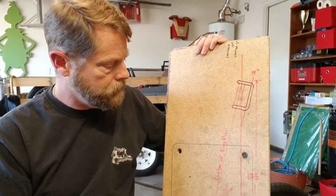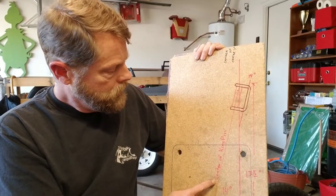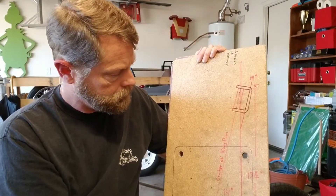I'm running a quarter inch toe-in, so the front wheels are toed in a little bit — measuring from the center of the tread, it's a quarter inch narrower at the front. Kingpin inclination is 14 degrees, which is what works for this height of wheel. You can adjust that a little if you like, but 14 degrees is what Albert uses — that's where I got the idea, thanks Albert. It seems to work great: the car turns great and handles great. I drove Al's cart and it drives so nice. I'm hoping mine drives half as good as his when I get it on track at speed.